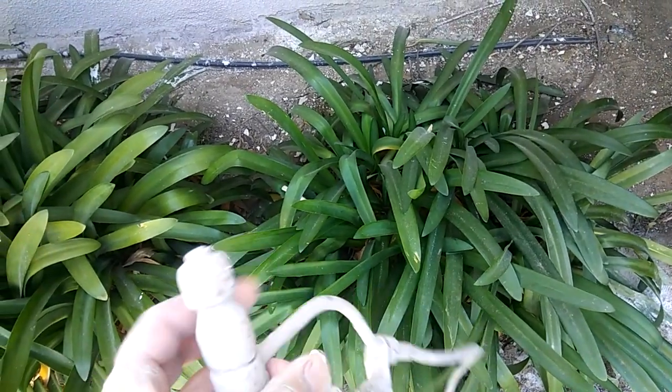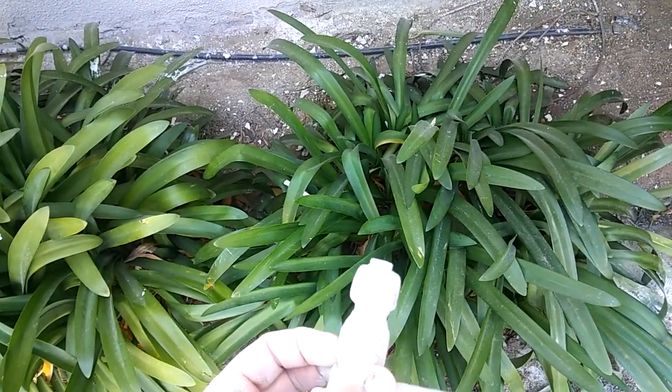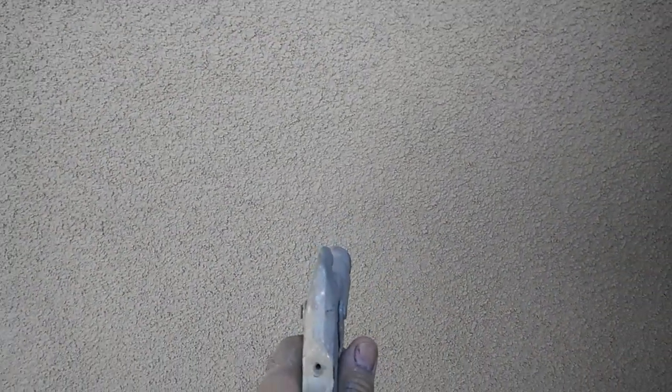So you need to get rid of your original reversa tip, because what they do is when you spray, let's do an example here, you'll see on the ends two heavy fingers on each end, and when you spray, that area swirls around and you're losing paint, and you're wasting money, and also making overspray. You're having to cover twice as much. So let me talk to you guys about technique. So that's setup. You need to have this setup, okay?